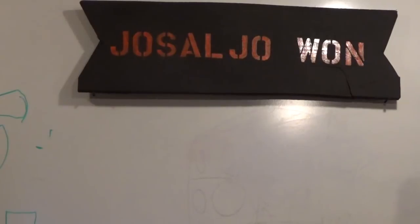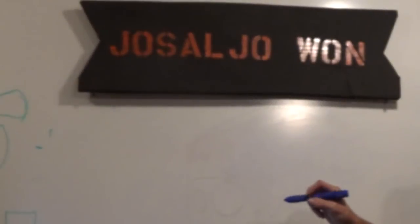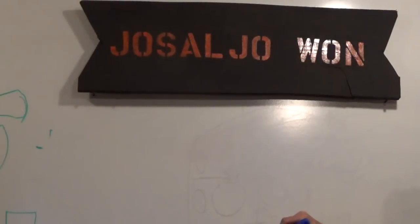So here's what I noticed. It does not matter what you use to treat the ends of lumber as much as it matters how you treat the lumber to begin with. In other words, you can cut straight grain lumber, either slab cut or quarter sawn, throw it on a pile with uneven stickers and 100 degree temperature in direct sun, 50-mile-an-hour winds and 10% relative humidity. You could put 10 coats of Anchor Seal and paint on the ends of the boards, and they're still going to check, split, and warp in a matter of days.